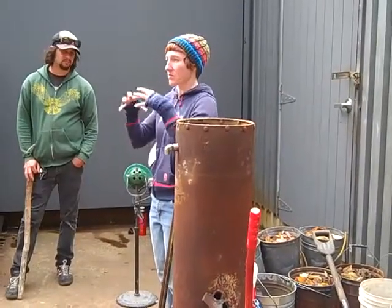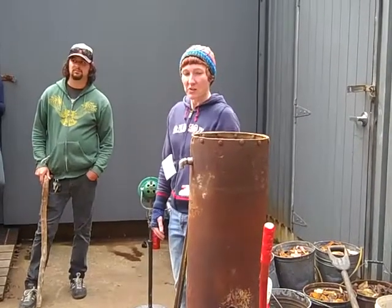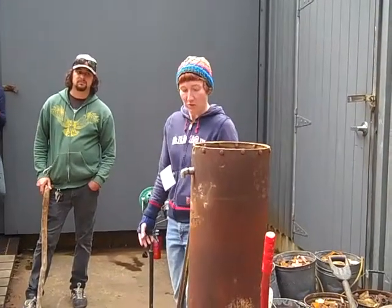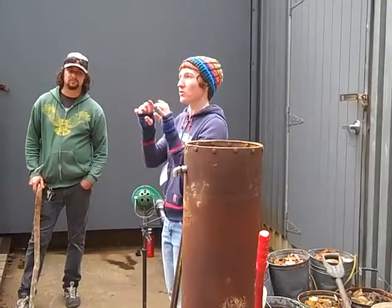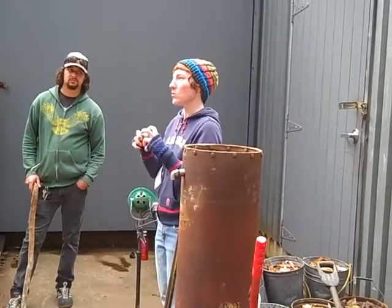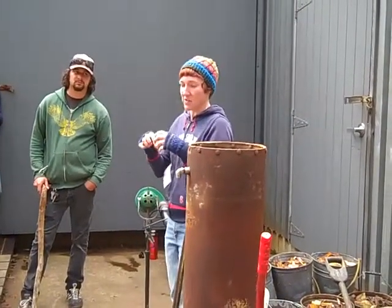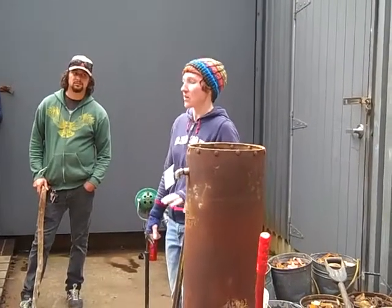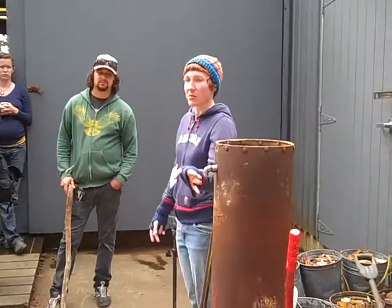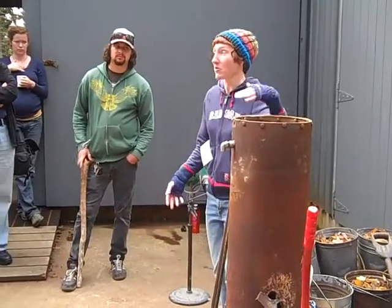Iron, so it's kind of in this oven, protected. Once it starts trickling down, we call it raining iron, because when you look through the tuyere hole, you can actually see it starting to drip. When it first starts, it's really globular, which is pretty cool. Then it starts really running and dripping down. When it slows dripping, it means the iron in there has mostly melted. So between that and the slag hole, we know when to tap the furnace. You can also do it just from how much you're putting in.